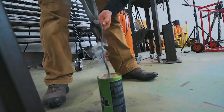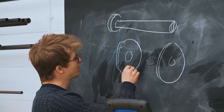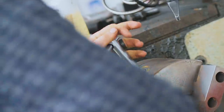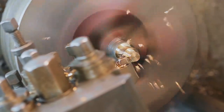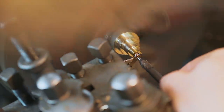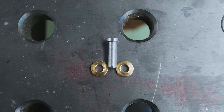Into the quench. While we get the blades tempering, I'm going to be making two washers out of bronze and a steel rivet — that's going to be how we secure the thing together. The rivet and washers are done. Let's put it together.